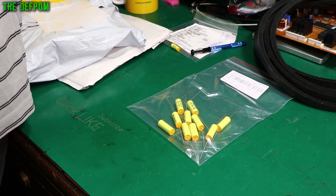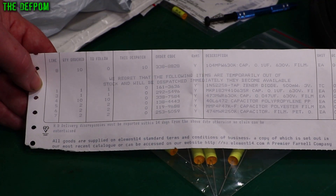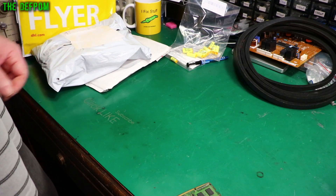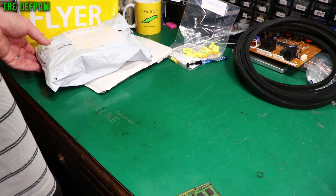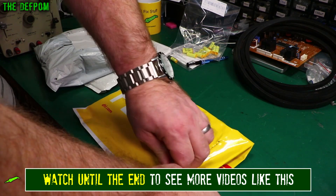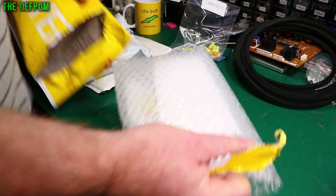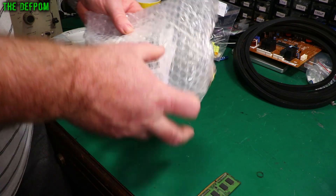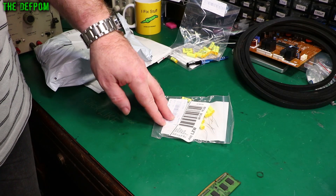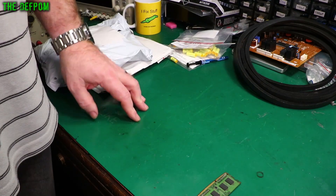But you should see the invoice — all these things are out of stock, and they have items that aren't in stock right now, which is a problem. These capacitors are needed to replace paper caps in the valve equipment I've got sitting over here. And these are .047 microfarad, 630 volt film capacitors. Same deal — valve stuff.